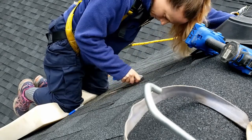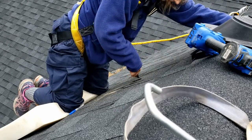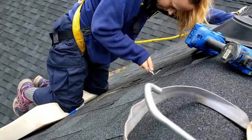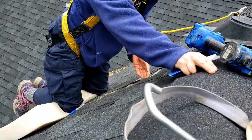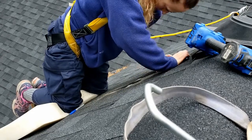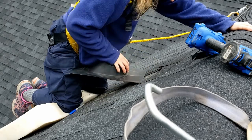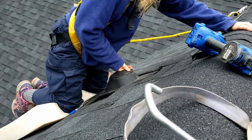So now I'm just using a razor blade to cut the top layer of shingles where I marked. Next, you are going to slide the roof boot into place just to make sure it fits in the hole that you cut out of the shingles. It's possible that there might be a few roofing nails in your way — if there are, just put a pry bar up under the shingle and pry the nail that is in your way.